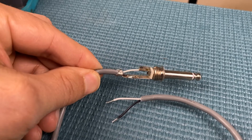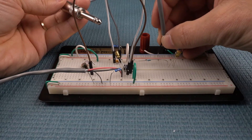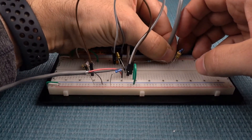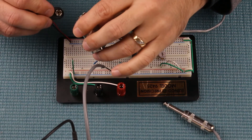The sleeve is connected to the 9V negative lead or circuit ground. The output of the circuit is connected to a quarter inch connector, with the output to the tip and the circuit ground to the sleeve. Now is the time to power up the circuit for a little testing, and will do so with a 9V battery.